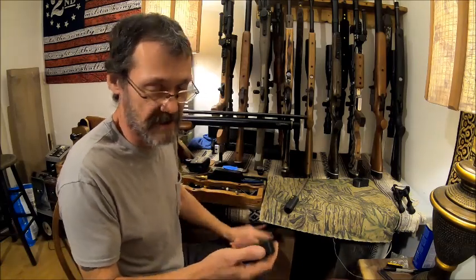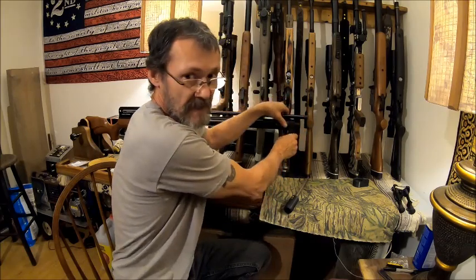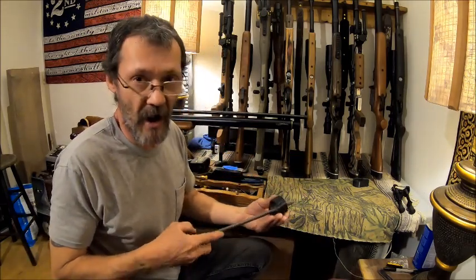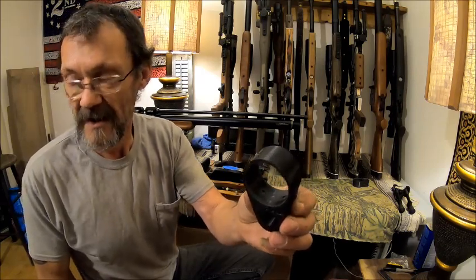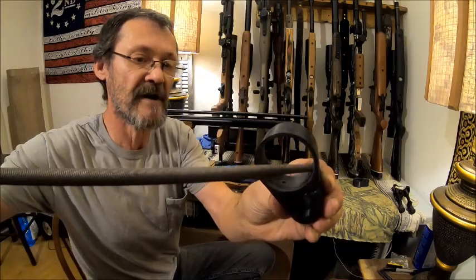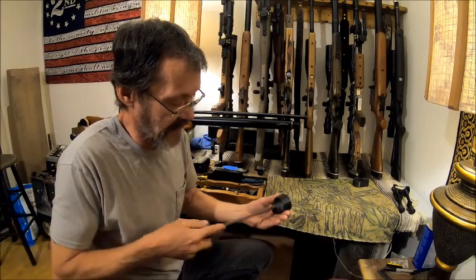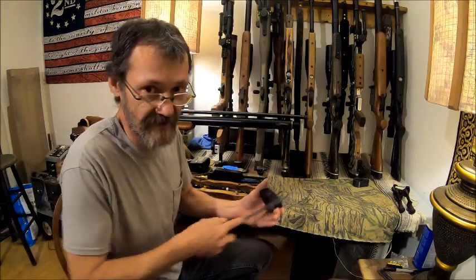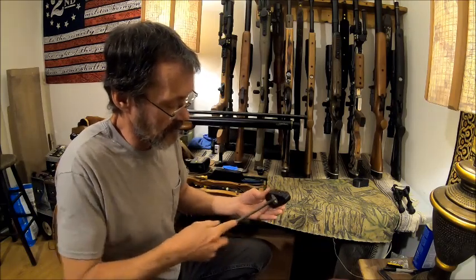We'll try it again — and you'll have to do that again. See, it still won't fit. Now let's see if it'll fit the other way. Now the middle is high, so now we're going to go straight across and concentrate on all of it, not just that one side. I don't know if you can see the light in there where you can see the shiny part, but there's a shiny part right here which is not being touched by the sandpaper — that means it's a low spot. We're just going to go around and try to get the high spot to meet the low spot, but you don't want to get crazy with it because we don't want it to be loose. And then I just work it all the way around.